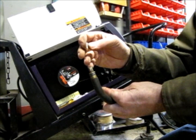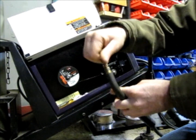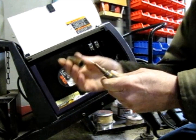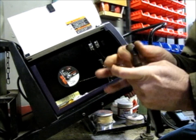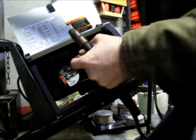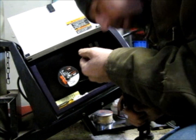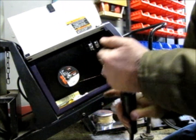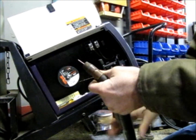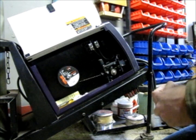Just take and slide your tip on over your wire, put that on there, take it all the way as far as you can go with your finger, and then take the pliers and just snug it. Slide the diffuser on. And then I take and put it on purge and turn my gas on, since this is going to be a solid core wire we're going to have to use gas. I make sure I get gas blowing out the tip — just hit the trigger a few times and I can feel the gas coming out the tip, so it means I'm ready to weld. Now the next step is just setting it up for whatever it is you're welding and your wire size, and we're ready to go at it.